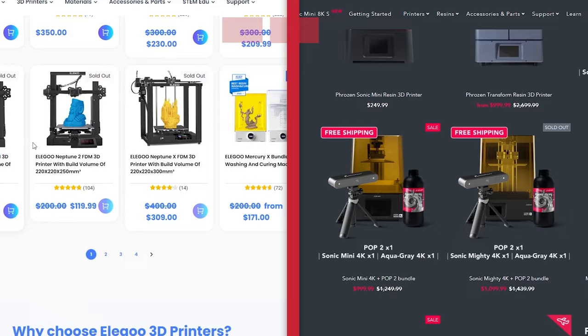Resin printers deliver much higher quality, and a larger printing area allows you to upscale larger pieces with fewer cuts. While resin requires careful handling, this is not an impediment to using the technology. There is also a wide variety of files available specifically for filament printers, and despite lower quality, FDM is still extremely valuable for printing many types of parts such as terrains, props, and statues. There is use for both technologies, as they work with different materials and applications. Tell us in the comments below which printer you think is best for you after watching this video!